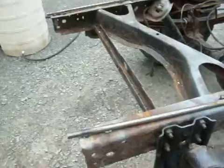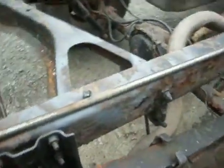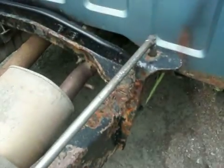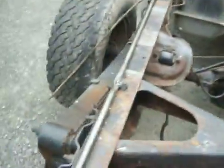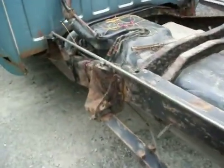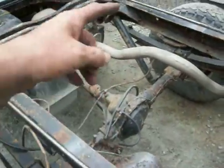I'm in the process of making a tram gauge. A tram gauge is used to locate something or keep something at an equal distance, especially when putting something together or taking it apart. This gauge is made of three-quarter inch or five-eighth inch bar stock, and all I did was tack some uprights where the bolt holes go. They're the length of where the bed brackets will sit. I need to be able to locate those precisely later on. I'll weld some pieces across to the opposite side, maybe one or two on an angle to keep it in line, and then use it on the frame I'm working on.